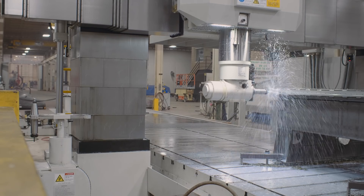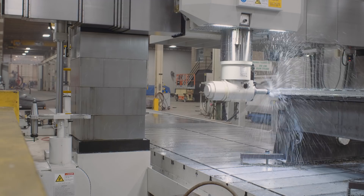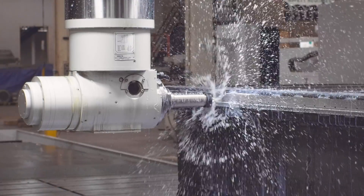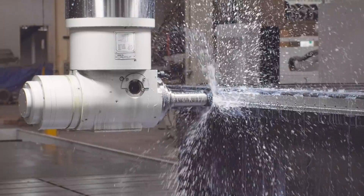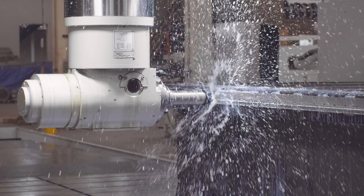What you see on the screen is a great example of that. Now, this is an aerospace mill. This is one of our frames, and because it's steel, it requires flood coolant. So if you watch as the tap goes in, it'll go in to the bottom, and then it stops and backs back out. That's rigid tapping.